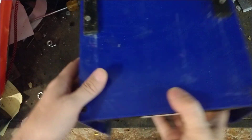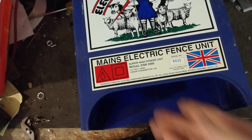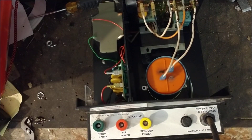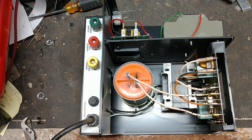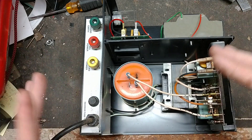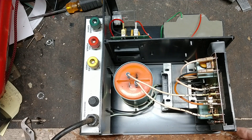We'll take this unit apart. There's nothing extra inside the case. There's a little lens on the side that flashes red-orange with every pulse — those lights are actually these two right here behind the clear lens. To give an overview: this is a 220-volt internal unit. This transformer takes 110 volts and converts it to 220, and that goes up to the board, so it internally runs as a 220-volt model, which is what they sold over in England.